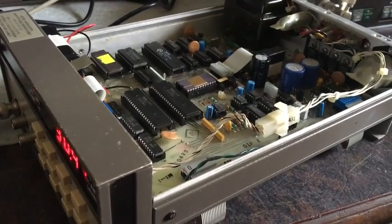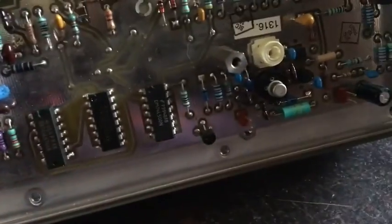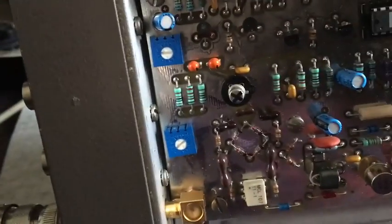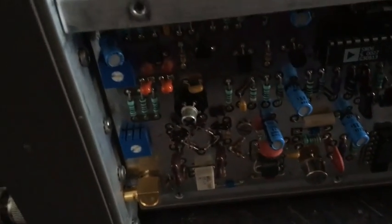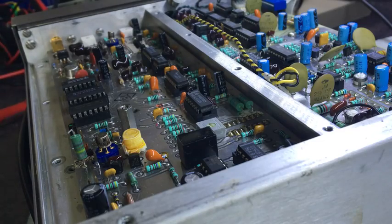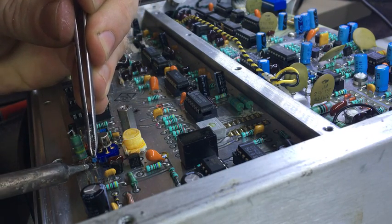I did have an issue with the FET though — I think because it wasn't oscillating. I swapped the FET with another identical one in a different part of the board. There's a FET there which I've got a cross on — that's the oscillator section. I swapped those two FETs around, they're the same part, and then it started oscillating. So I think that FET might be faulty, though the unit is working which is a bit strange. I'm going to try and take these parts out without taking the board out — it's a double-sided board and I can probably just solder from one side.